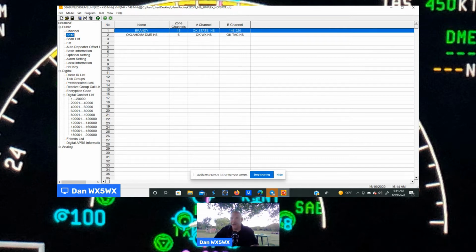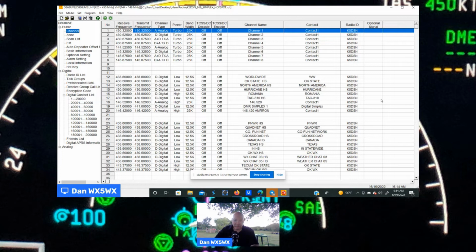Okay, so over here, the channels, you guys are familiar with channels, right? But look at all these channels. Now, something I want to clear up right away that confused me when I first was starting to program DMR radios. Every talk group you want to use must have its own channel. I know that's like, what? Yeah, so if you're going to use worldwide talk group 91, you're going to have a channel programmed with that talk group. So let's just use an example here. That's something I've got programmed in here.